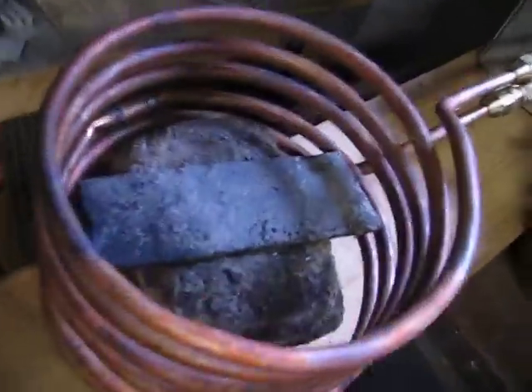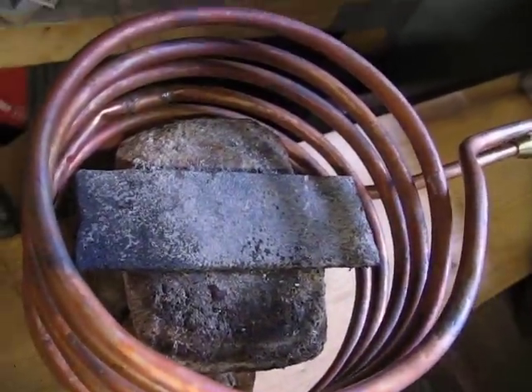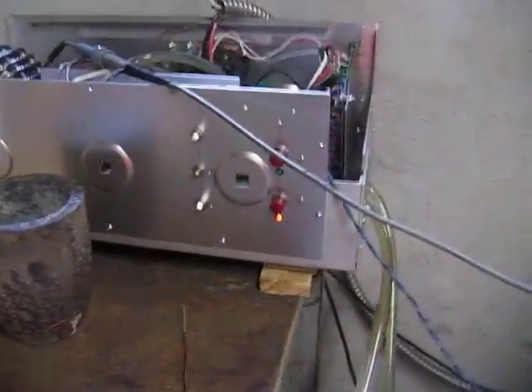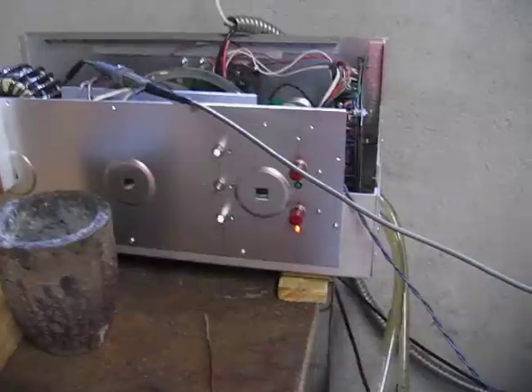I have a slab of steel in here right now. If it were vertical, it would be heated by hysteresis loss because it's magnetic, but because it's horizontal, there's very little magnetic field going through it, so it'll heat around the edge instead. So we get a very graphic representation of the skin effect in this example.